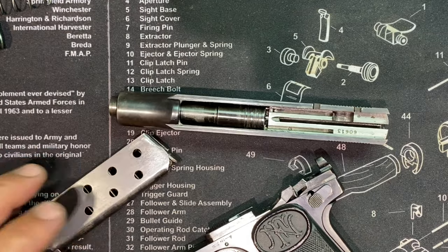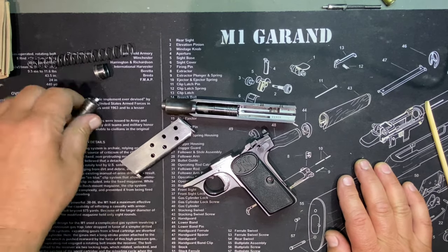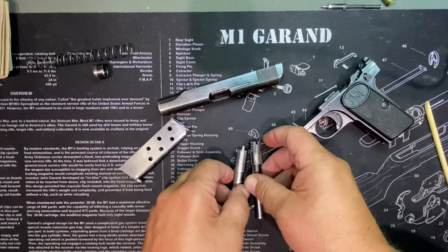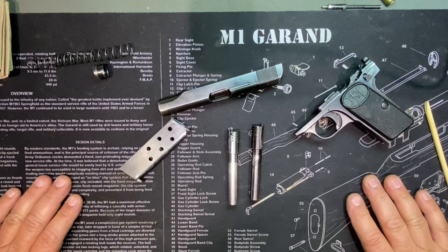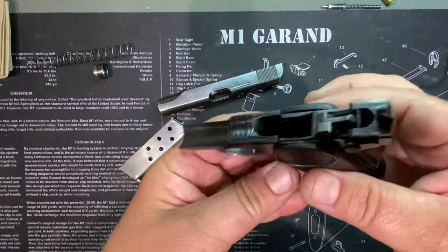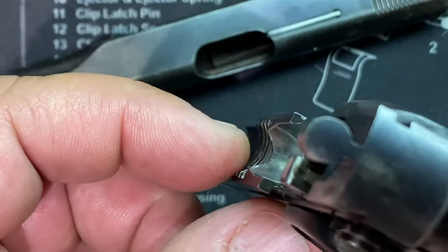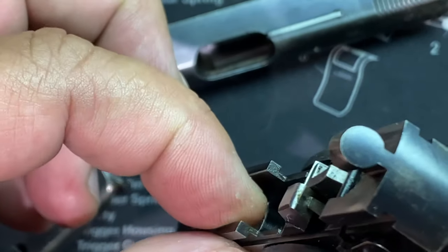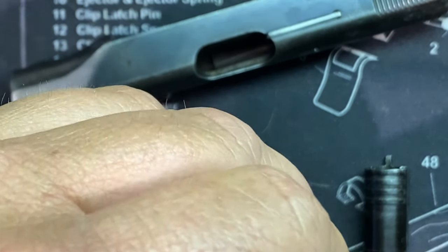So what we have to do is make this fit. So it's nonsense that they're just interchangeable. I mean, they're interchangeable, but I think I'm getting an idea of why this wasn't just offered in a case. But then again, if you fitted both to the gun, yeah. But maybe it's not possible. Because this part of the feed ramp here, let me zoom in here. If you really start studying this whole feed ramp technology, you see there's a curve to that. There's a certain pitch, there's a certain way it's smoothed out. It's matched to the 32 caliber.